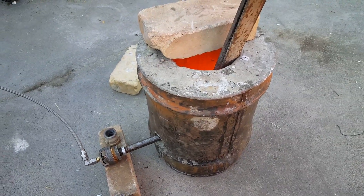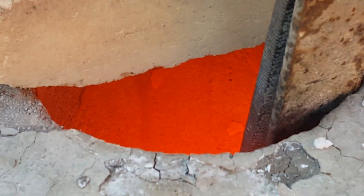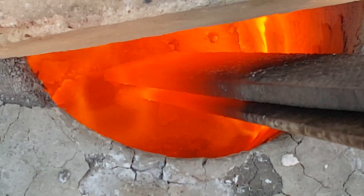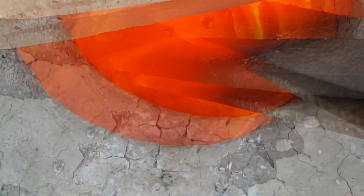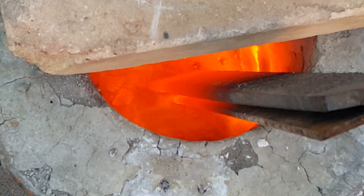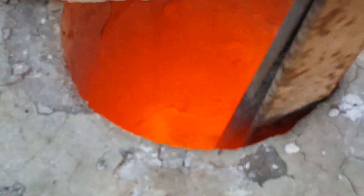My aircrete forge — what's kind of interesting is the Portland cement and water glass all cracked up on the outside, but underneath you can see in there that the cement is going red-hot and it's not cracking or anything. You can see the holes I drilled in the concrete in the bottom that I filled with water glass. It held up great in a rocket stove. The wall on the inside is glowing red-hot — it looks so good, it's not cracked, it's beautiful.